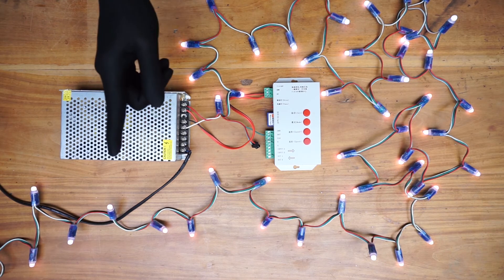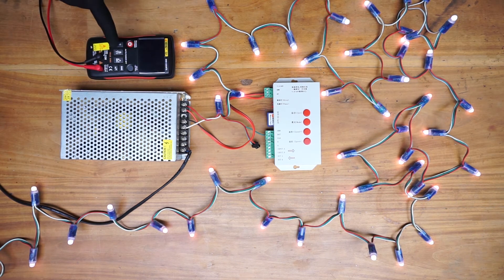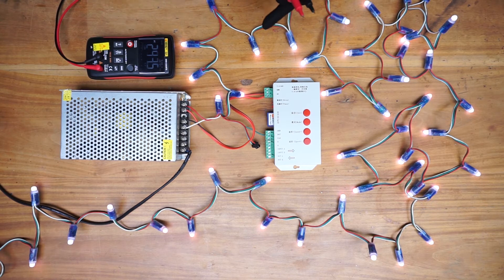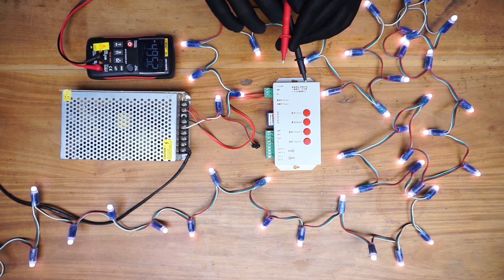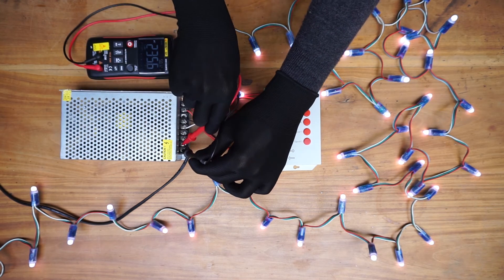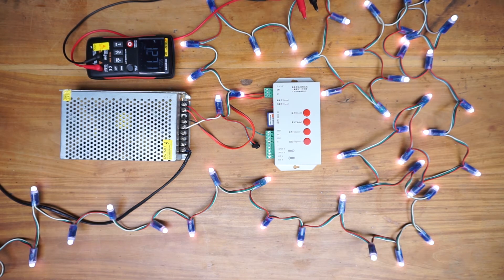To do that, I'm going to use a digital multimeter. The input voltage is an AC voltage, so you have to put your multimeter into AC mode. Be careful when checking the input voltage because it is a high voltage — if you touch these terminals it can be fatal. As you can see, it's about 235 volts AC.